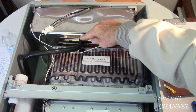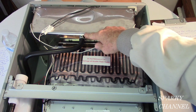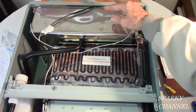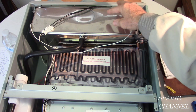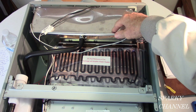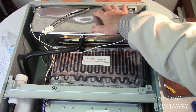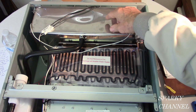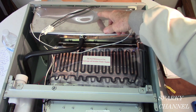And you see, you have a condensing tube coming out of the secondary heat exchanger. This condensing tube collects water. In a typical hot water heater, the gases that escape are about 300 degrees. Gases that escape from this unit are going to be somewhere in the neighborhood of 100 to 150 degrees, much lower. I've heard 100, I've heard 125 degrees. Anyway, the gases are much lower. I'm sure it would vary with how hot you're trying to heat your water and so forth. But the gases are around two or three times lower in temperature.